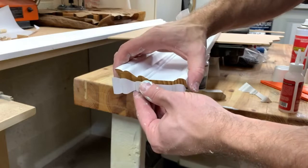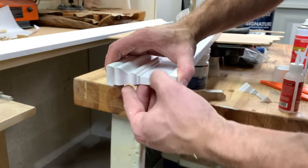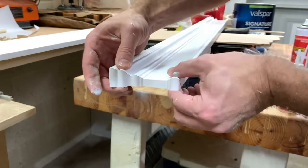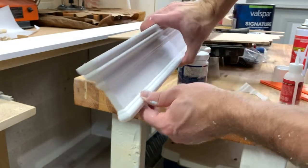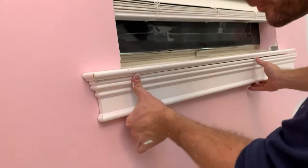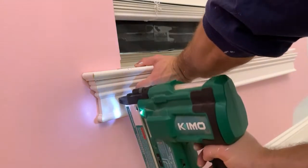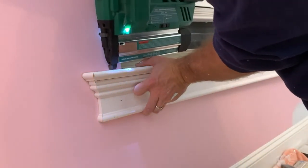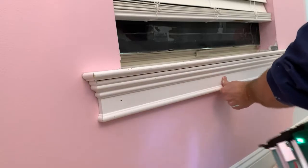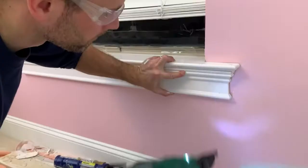This is the right way to do it — this is the way I was taught from the construction worker I worked with in high school and college. There may be other ways to do it, but this is what I was taught and I think it looks really sharp. You get that nice finished professional look with the return on there. Bring that up to the bedroom, attach it, and it covers up those chunks I took out of the drywall — so luckily I don't have to go back and repair that. And if you wanted to, you could stop right here: caulk and paint this and it would look really sharp, a lot better than the composite sill that was in place before.